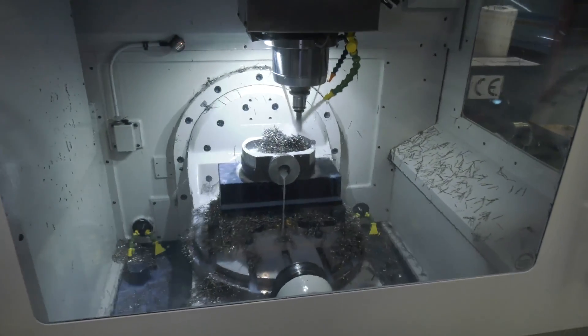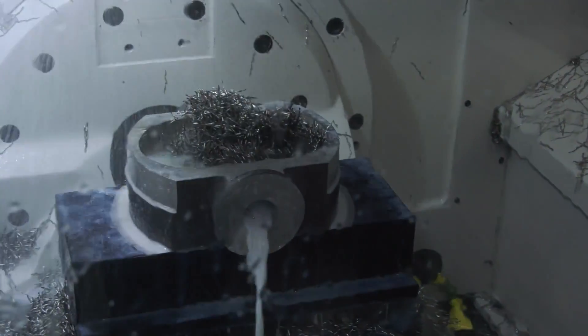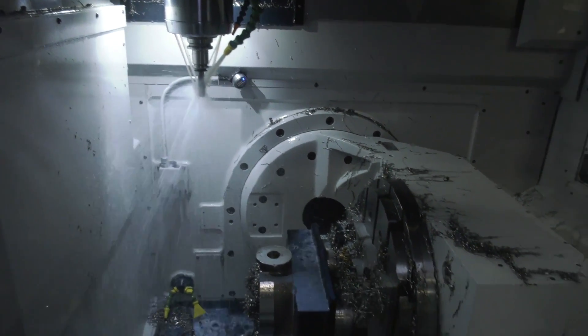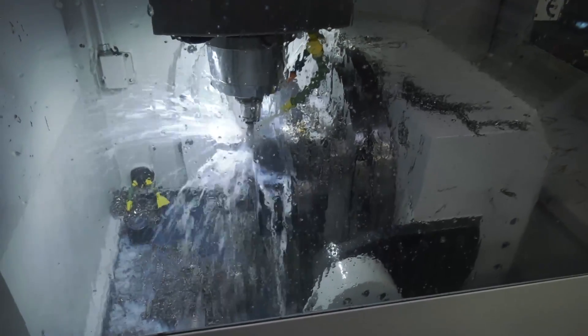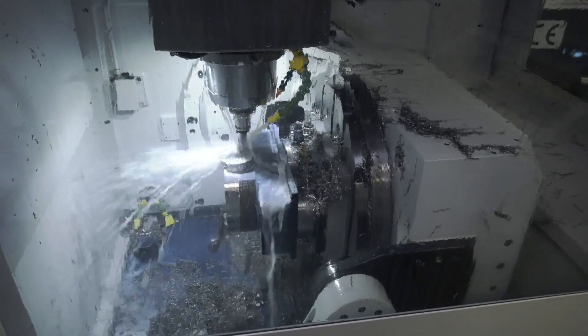Now we're cutting the outside diameter of the body — is it a similar cut? Exactly the same — running at about 2,700 RPM and about 2,400 feed. What about the coolant? This is actually a brand new coolant — we're the first ones in this country to use it, it's from Gemtech. The surface finish has been great; the sizes hold extremely well. We probe the rotor bores not only on diameter but top to bottom to make sure they're not tapered, and they're within microns.